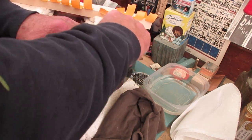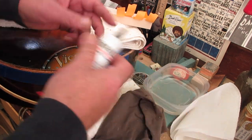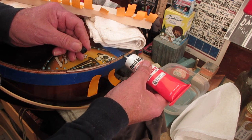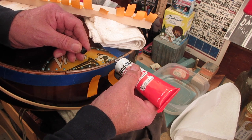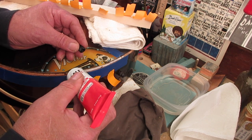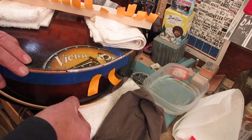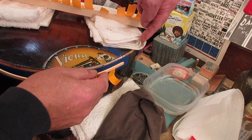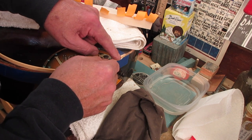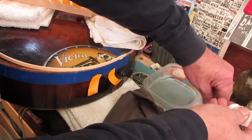We've got the bottom glue is going to run down. It's not going to levitate. And so we're going to take a little bit of this binder glue here and start at the mark. And notice it's gelatinous. There we go. Then take that beveled end down. The other end is going to slip in here, and we want to pull it past there a little bit, like so. And you can see that based on what's popping out there, how much you need to put in.